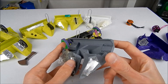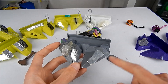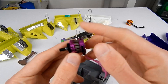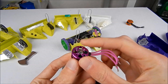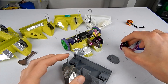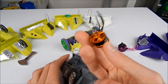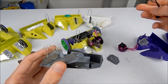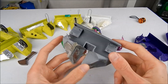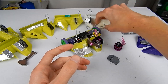At the same time it was a pretty good test of this robot and what it might actually be able to do. There was another difference between these two versions: the first version had these purple brushless motors — this is a busted one here — with bigger M3 bolts to attach to the robot. The new version had an orange version of the same motor by the same company, using M2 bolts. I did that basically to save weight because this was pushing right up close on weight, and the top cover in the first version was basically tape while the second version actually had some plastic in there.